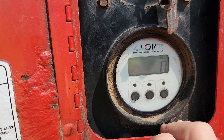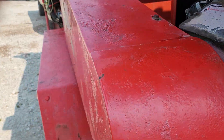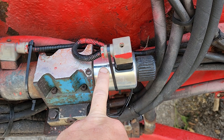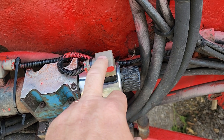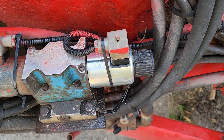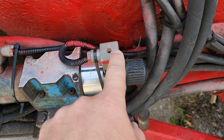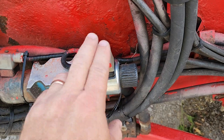Another thing to note is there's a red LED right here — when that red LED is on, the solenoid in the back is providing 12 volts. The solenoid right here is on all the time, so when we start this thing up we should see the auto feed working. There's also supposed to be a red LED in this connector, but I think it's burned out and no longer working, so you can't see the light lighting up. I'm going to review replacing this soon so you can understand when the 12 volts is engaged back here.